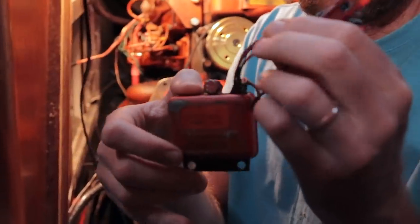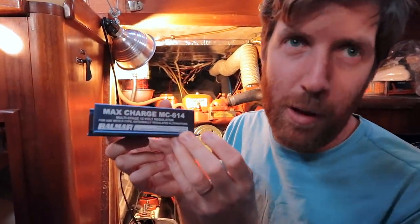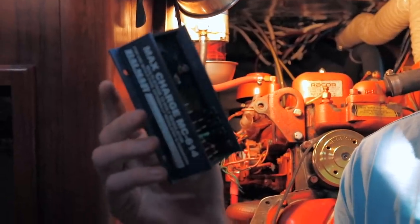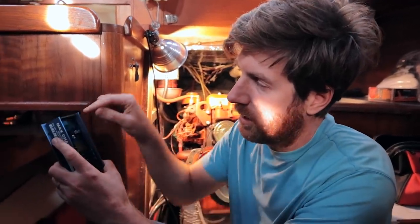We just pulled this off the engine — this is the external regulator for our old alternator. This is all the wiring we're cleaning up. And this is the new Balmar Max Charge MC614 regulator, which we're going to mount right up in here. Balmar recommends it not be right in the engine bay — they want it a little bit cooler. We also have to program this every once in a while. You hold a magnet to this little red dot and it cycles through settings, which is real slow. So we'll have a long enough wiring harness to pull it out, see the display, do the programming, and put it back — not having to be all crouched and twisted. This was Lauren's brilliant idea.